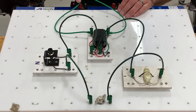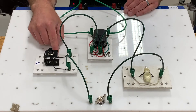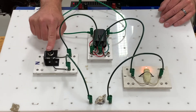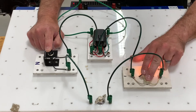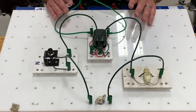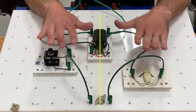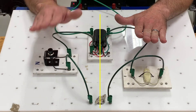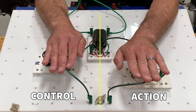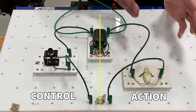On the control side, I've still got my 12 volts going into the coil, and I've provided a ground path through my momentary switch. On the action side, I've taken 12 volts coming into the relay, going through that switch when the switch is closed, which allows this 12 volts to come out, go to my light bulb, with ground on the other side of that bulb. Setting up this board is really effective for early students with relay circuits — it creates a clear visual divide between the two sides of my control and action circuits, being deliberate about setting up just the control first, verifying that it works, and then adding the action side separately.